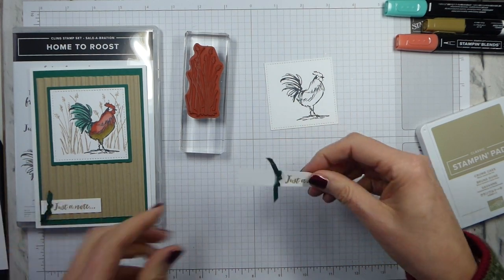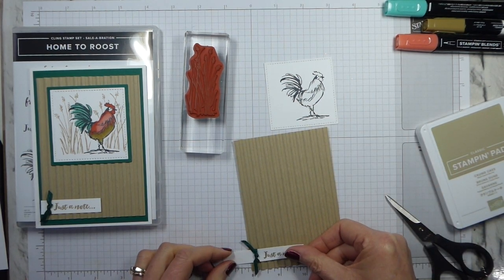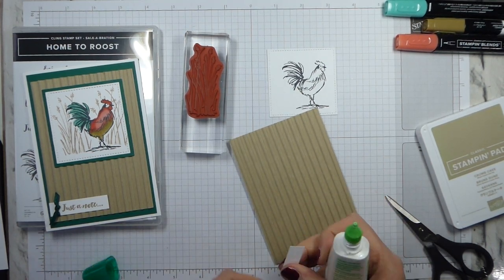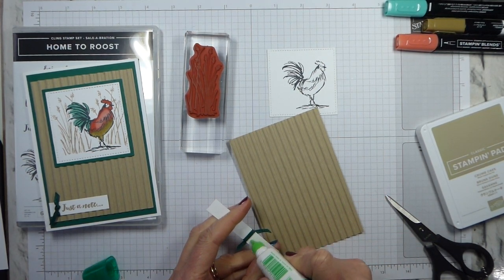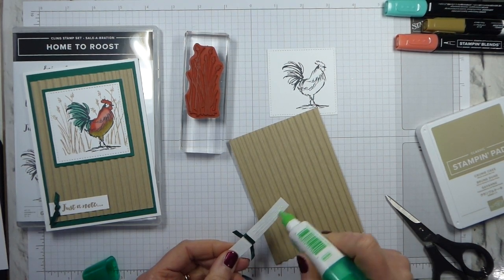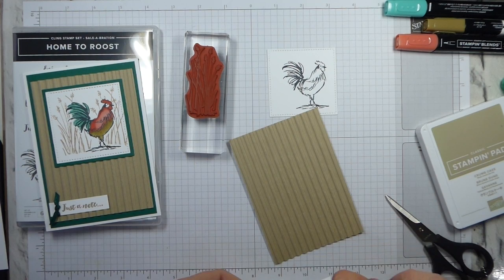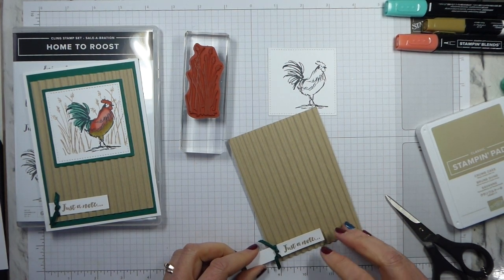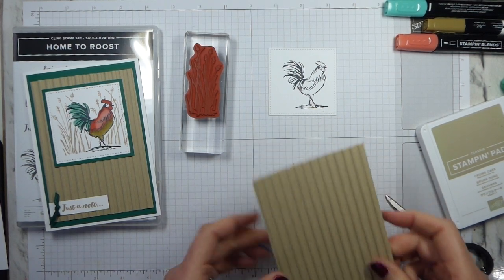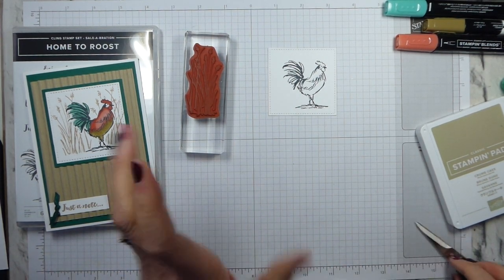Because I want it to come to the edge of the corrugated piece, I'll start putting that together now — that's going to go down there. The key to this is that because it's corrugated, you want to make sure that you actually get adhesive sticking to the corrugated bits. So I'm putting a bit of multipurpose liquid adhesive there and then running more across the back. This is more than I would normally use, but that's because we have less surface area to stick to. Then I'm just going to pop this down at the bottom. I'll pop that to one side with a block over the top of it, just to help everything stick down.